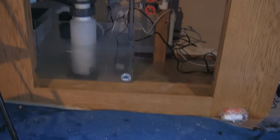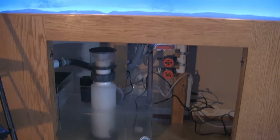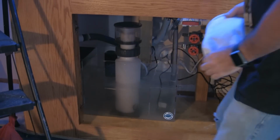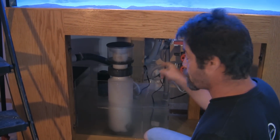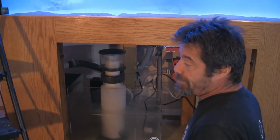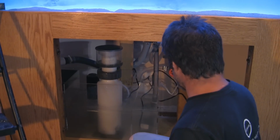And it's a pet peeve of mine that just irritates me. We could put a bigger pump on the system to try to raise that water level up, but I think the overflow, which has big teeth in it, is going to swallow all of that. Even though we could benefit from the extra flow in the system, I'm not sure the filter is capable of taking that increased flow. Plus, we set this system up for 3/4 inch plumbing for the pump. And the way everything is plumbed right now, putting in a bigger pump really wouldn't do an awful lot for us, in large part because it is kind of restricted.